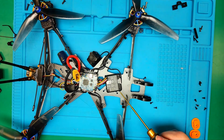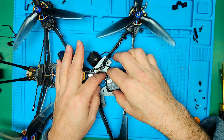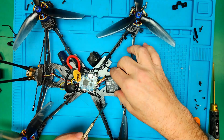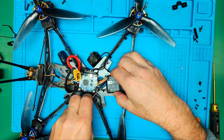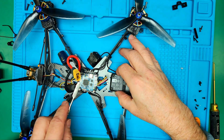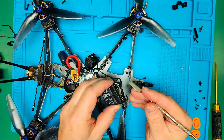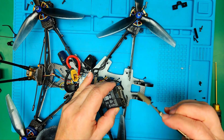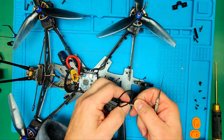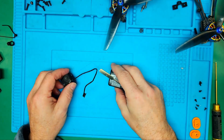We are removing the cover from the top of the air unit very carefully because there is a ribbon underneath here — we don't want to pull it out. We're going to undo the antennas here, these tiny little connectors. Very easy to snap off. These are the two extensions going back here to these antennas. While we're up here, we're going to go ahead and remove this cable here — and off it comes very easily. Here's the camera right here. We're going to place this quad aside and I'm going to work on the air unit and the camera alone.